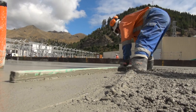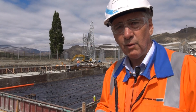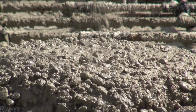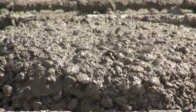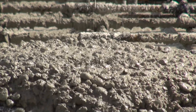The operatives and concrete placers working out in filterbank 5 were here for the first major pour back in August 2010, when they poured 350 cubic metres in the undercroft for the transformer bay. We've been pouring this for about the last three weeks — there's 83 cubic metres in each section, which takes a bit of time. They're going down well, though we've had a bit of trouble with the concrete mix consistency sometimes — just got to sort out the right mixture.